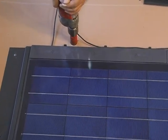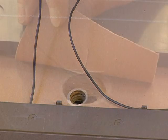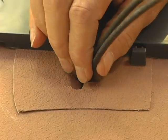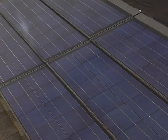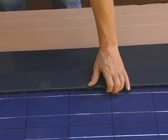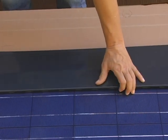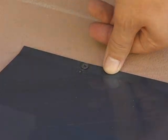Once you've completed the final course, you are ready to drill the roof penetration hole, through which all home run cables will be inserted. The hole should be drilled near the top of the final course so that it can be covered with the top vent. We recommend the hole be lined with underlayment to avoid chafing the home run cables. Once all wires are inserted, the hole should be filled with fire-stopping foam or silicone. The area above the top row, including the penetration hole, will be covered with the Sun Energy top vent, which is secured to the roof using four Sun Energy top vent retainer clips. The clips are placed under the screws that secure the shingle to the roof deck. The top vent is then slid under the clips, screwed to the roof, and eventually covered with composition shingles.